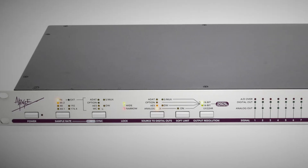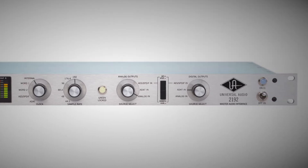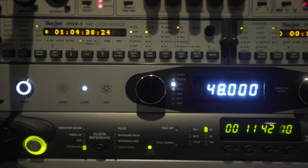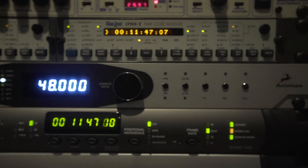We use Pro Tools Digital Audio Workstation as the front end for all of our transferring and archiving work here at United Archiving. We use a combination of various different high-quality analog-to-digital converters. I work with the clients to discuss which converters we would like to use for either a two-track or a multi-track format situation, arriving at what both myself and the client are most comfortable with in terms of the A-to-D converters, which are so important in the analog transfer process.